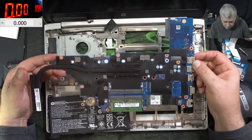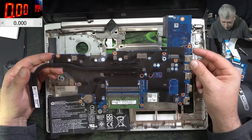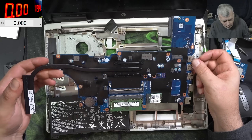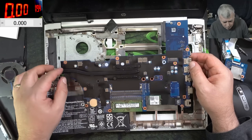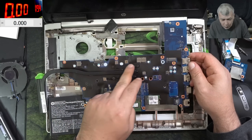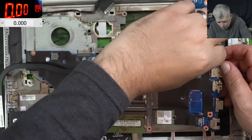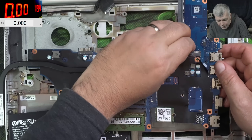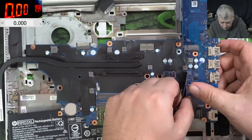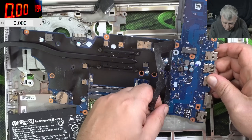The motherboard is out — it's untouched. We have a USB-C here I didn't see before. We have a big coil here. I can't see anything melted on the plastic to give us a clue about what we are looking for. To fix it, as always, we have to figure out the schematic. We already saw the first two MOSFETs but we didn't find the current sensor.